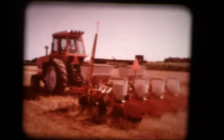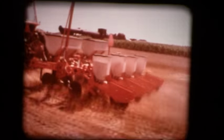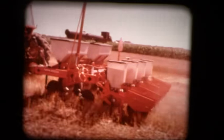This close-coupled system assures that the no-till coulter and opener work as a team to assure planting accuracy while eliminating the effects of hillside draft. The no-till coulters are mounted directly to the frame for maximum down pressure. Planter units are mounted independent of the no-till coulters to follow ground contours while reducing unit bounce. The new no-till special, an Allis-Chalmers exclusive, is better designed for double cropping or planting crops directly in the residue from the previous year.